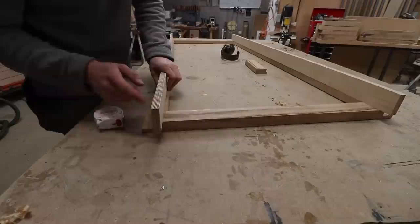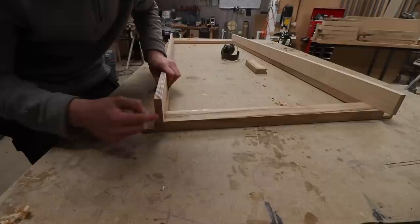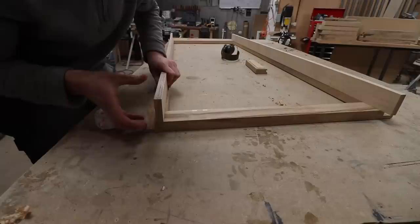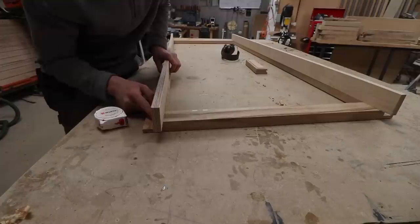But it's also going to act as a fixing point, so I can screw through this past that plaster bead. So you'll have a metal angle bead in your plaster work of the opening. I can fix this to the frame, then screw through from this into the plaster work that will be here into a nice brick fixing, and it will just hide the fixing. So once it's been put in place, glue all the way around and expanding foam in this corner where it all intercepts the wall nice and tightly, so it's going to be completely solid.